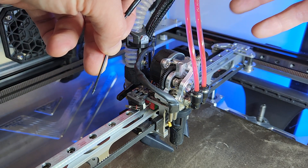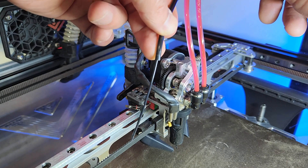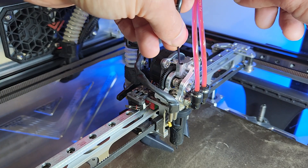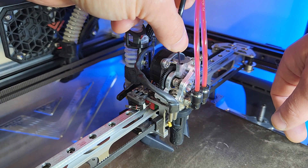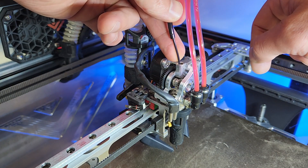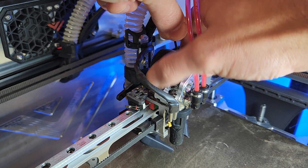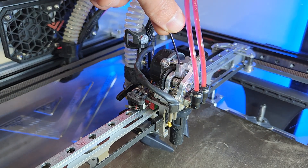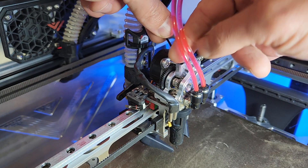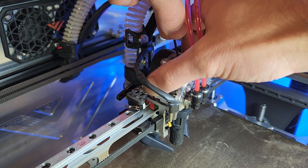So where is that zone? How do you know if you have enough? Here is how I do it. You have your PTFE tube coming in the back like that. Heat up your hotend to the desired temperature based on the filament you're going to be testing. Insert your filament in the hotend and load it — I just do this manually, it works super good. Now it's loaded, and I didn't have to touch anything on the lever — I just let it pre-tension, feed in, and push.